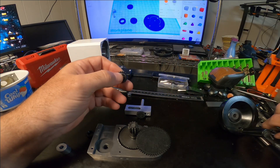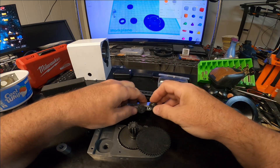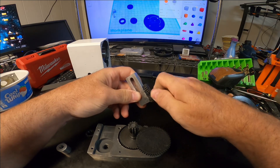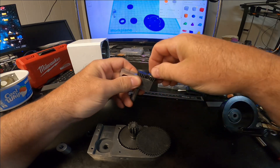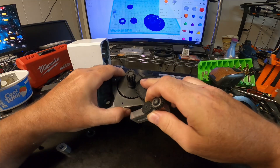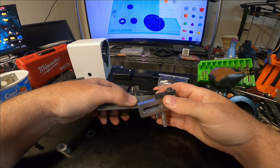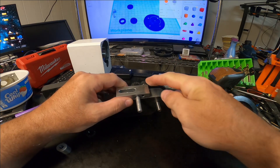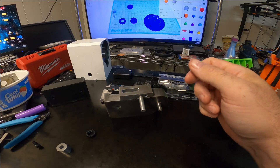There's a reason why I put two gears here. At first I only had one gear interacting with this one, and the handle started going backwards — you had to go backwards compared to the original. If you only have the one gear the direction is reversed, so if you add two gears it goes the correct direction.